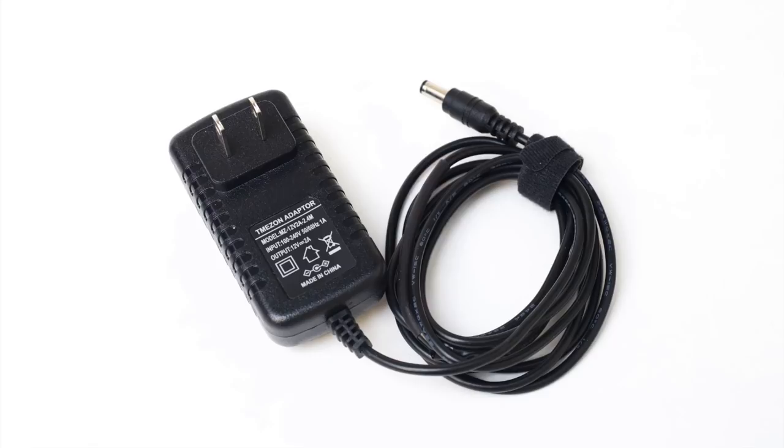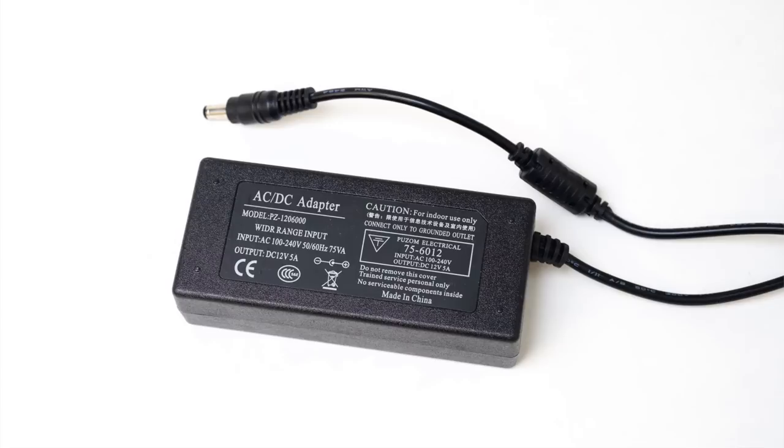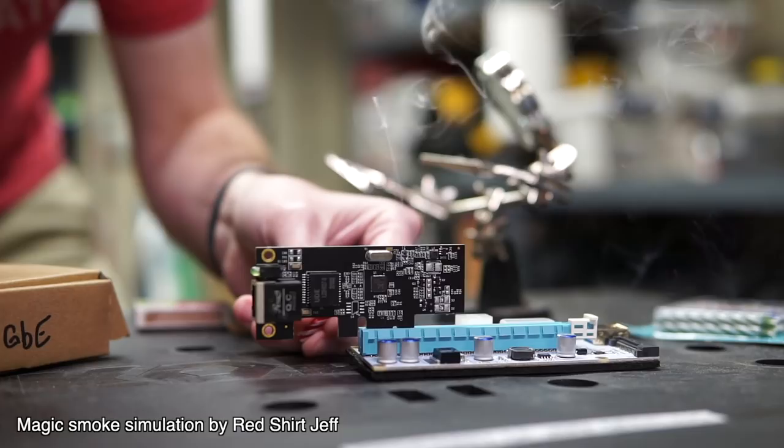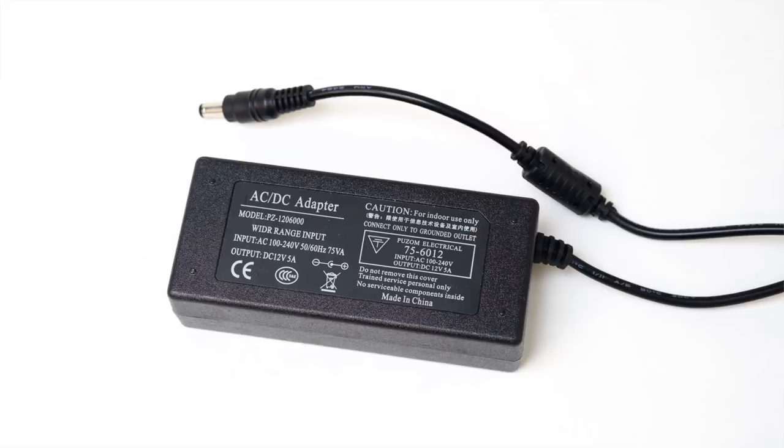The goal was to see if a newer card, designed in an era where ARM processors on servers were a thing, could work on the Pi's limited PCI Express bus. The first try was pretty rough. Right out of the gate, Josh sent over a driver that I had trouble compiling. I also realized the card needed at least 10 to 20 watts of power, and the 2 amp 12 volt power supply I was using with the compute module was probably not adequate, so I replaced it with a 5 amp power supply. I tried using external powered risers, but one released the magic smoke in one of my network cards, and when they do work they only work some of the time — like Russian roulette for your storage. So I chose to increase the amperage to the compute module board itself.